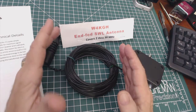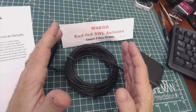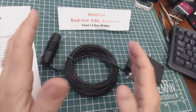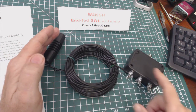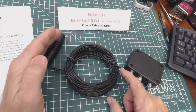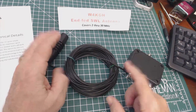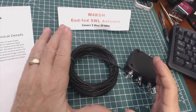That approach has a shortcoming. It's not as important for shortwave listening as it is for transmit, but it's still important for shortwave listening. The characteristic of this long wire antenna is that when you connect it to your radio at this end, it's high impedance — instead of the 50 ohms your radio expects, it's about nine times that much. So you have a mismatch, and when you have a mismatch you're losing signal into your radio.